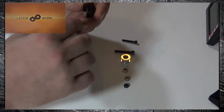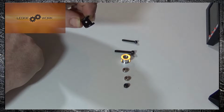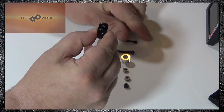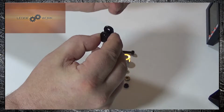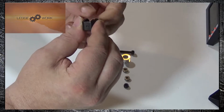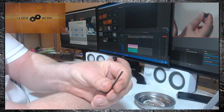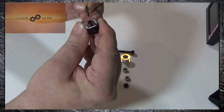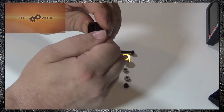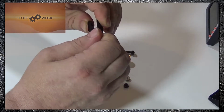First of all, you want to take the pulley bracket, which is this U-shaped metal piece here, and take the M3 screw and place that through the hole in the bracket at the back. Once again, you're going to be using the 2mm Allen key to get that started, and then you can just bring it so it's seated all the way like that.